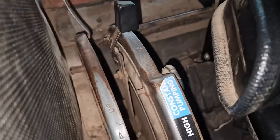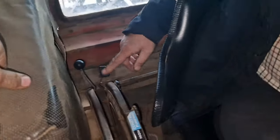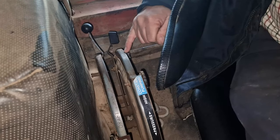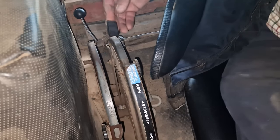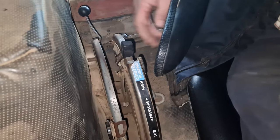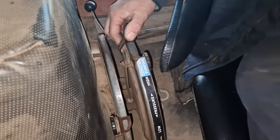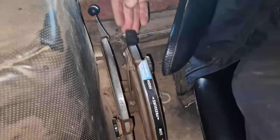So that's all the way up. Now, both levers all the way back on the Masseys don't mean up, because unfortunately that's your position lever - it actually says 'position' there. So you have one lever to do draft, and one lever to do position. To allow that to work and your arms to come up, you need that one to there. That's your position - wherever you put that, the arms should go to, quite simply.